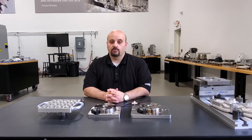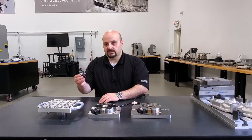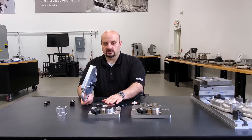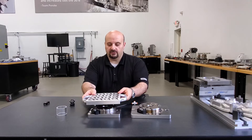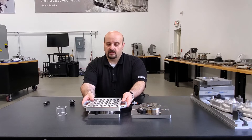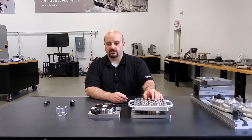The Unilock system is composed of two primary components: the clamping knob and the clamping chuck. The knob is attached to the underside of your pallet or your fixture, and the chuck is installed onto a base on your machine table. When air is applied, the chuck opens and your fixture is now allowed to be installed, and it will locate within 5 microns or 2 ten-thousandths of an inch. The fixture can also then be taken off and moved from one machine to another without having to remove the part from the fixture itself.